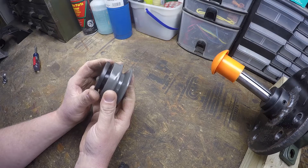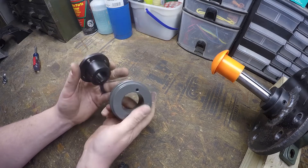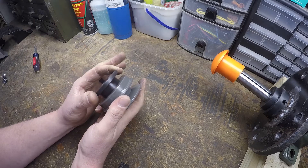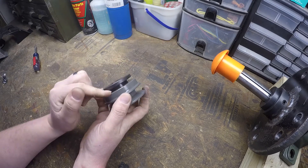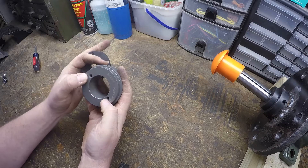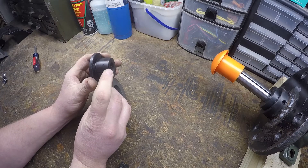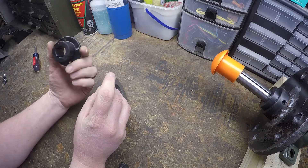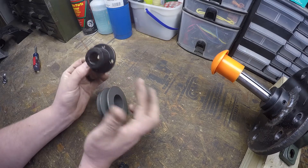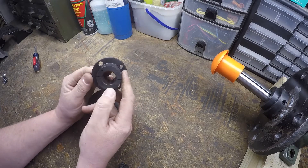The way these things work is the inner bushing has a split in it. It's machined at a taper and so is the pulley. You can see it only going one way because this side of the pulley is smaller. When you slide it in this side, it only goes in so far. Because of that taper, it gets tight and you use the bolt holes here, line them up with the corresponding holes here, and pull it down inside, which will force this split closed, clamping it down on the shaft. This one does have a keyway cut into it, but we're not going to use that because we have no keyway on our shaft. A taper lock will hold much tighter than a key will anyway.